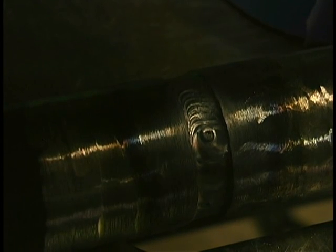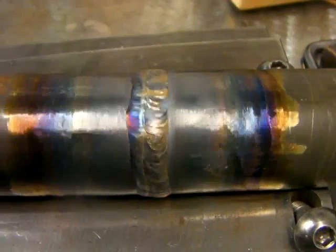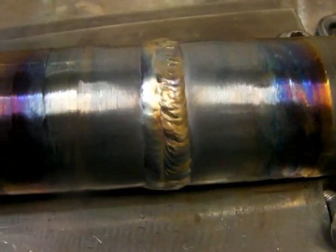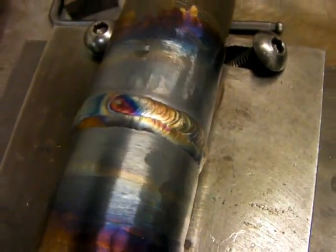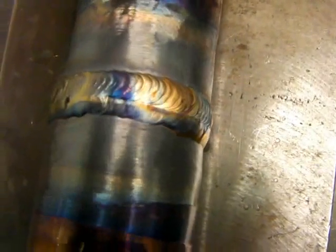Lay wire generally looks nice. There is a risk of cold lapping when you do it, but old-timers have been doing it forever and there have been many many x-ray joints done just laying that wire in there. Now this joint here stacked up for the cover pass looks like a patchwork quilt because I used like three different rod sizes and all kinds of different angles — sideways, horizontal — but it is what it is.